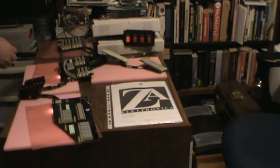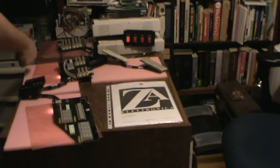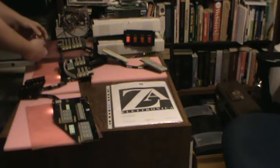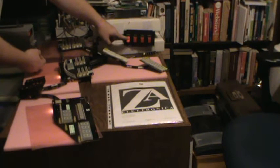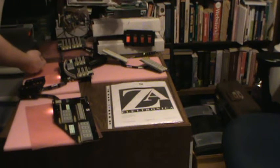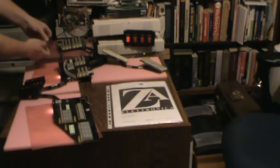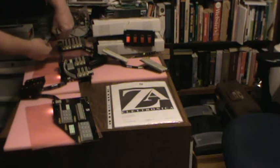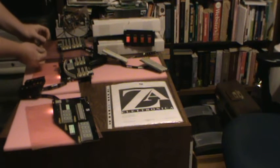Now, according to the manual, on wiring loom E, the brown wire connects to wiring loom C pink wires via this button. So normally you would push this button. I have not wired these buttons up yet. This lamp is lit by some alligator clips back there. It's not soldered together. So I'm going to cheat, emulate it. I put a piece of tape over my cable here so I didn't accidentally hit a hot 12 volt on something.